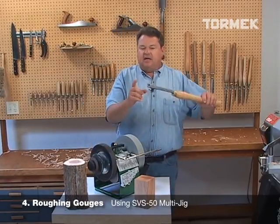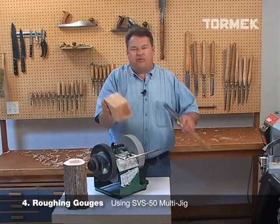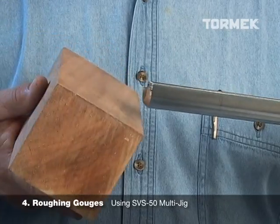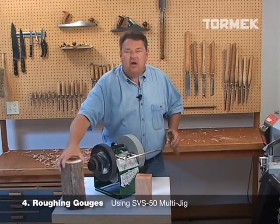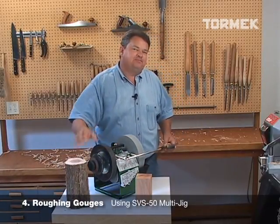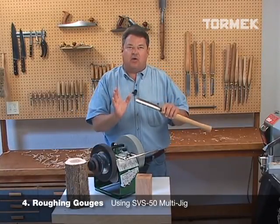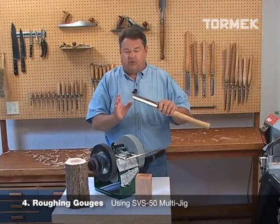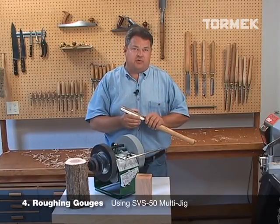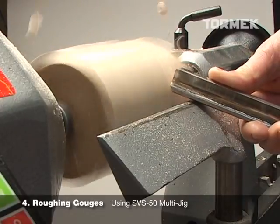If you think about it, the edge of that tool is going to take a great deal of abuse, either from the corners coming around and smacking it, or from the irregular section of the trunk making and breaking contact. For that reason, you want a relatively large edge angle, which results in a shorter bevel, 45 to 50 degrees or so. This yields a stronger edge that will stand up to the impact.